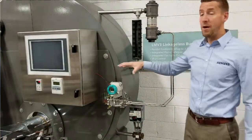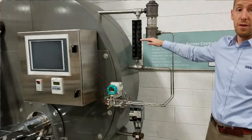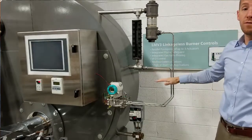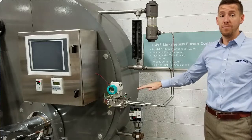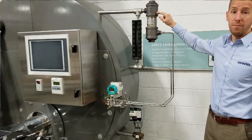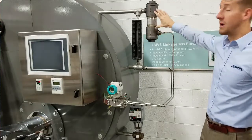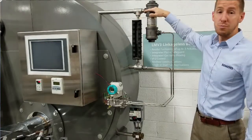The 7MF DP transducer must be mounted vertically below the minimum water level of the vessel. Since the reference leg and the working leg exert equal and opposite forces below the water level, it can be mounted any distance below this level. The reference leg should be filled with water at start up. At the top of this leg there should be two pipe tees or a condensate pot arranged as such, which keeps this leg full of water at all times.